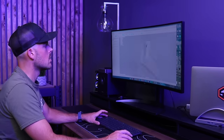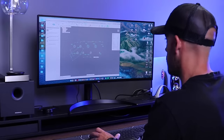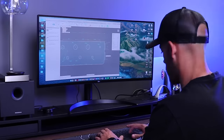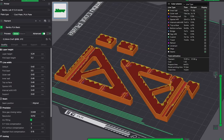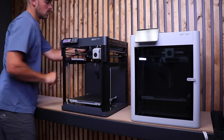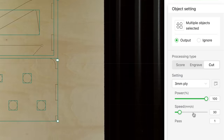I've got my notes and sketches, so now I can get to actually designing. For the 3D printed parts I need to create parts in 3D; for the laser cut parts I just need a 2D vector file. I used the sketches and measurements to create those drawings and export them into the right format, then created the file to send to the laser cutter and hit start. Those designs are now done — that entire process took about three hours, including both the 3D modeling and all the vector files. Setting up the machines adds about 30 minutes, so for the digital fabrication side we're now at three and a half hours.